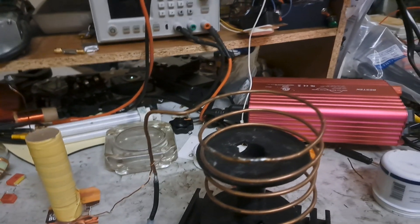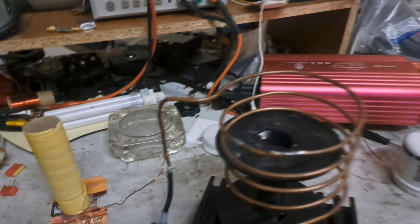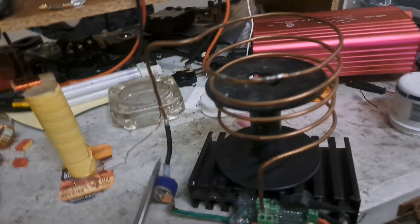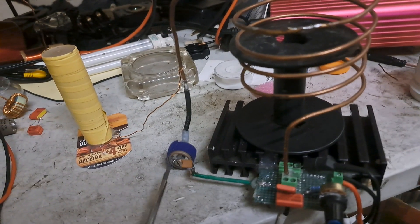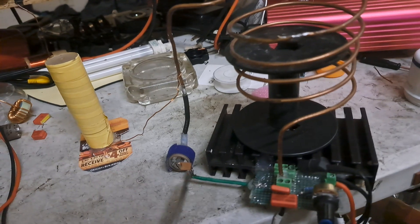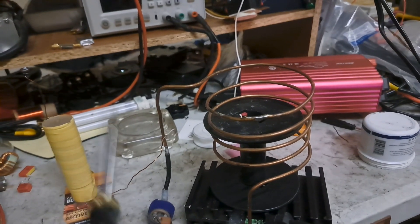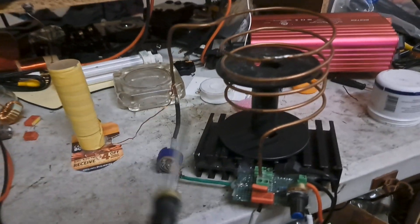I needed the frequency to be a little bit higher, so I might have to squeeze that back down. It's not really going to be a problem running the globe since I won't have a second resonator. I'll probably squeeze it back down and maybe stack a little more gate capacitance. I happen to have a secondary resonator that I wound in the past for this — it ran great with just this one cap and a little more inductance coming off the gate. Basically the same setup, but that particular resonator would run and spit pretty decent plasma at 15 volts or less.